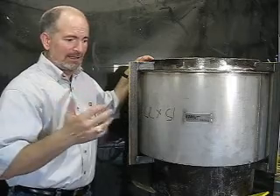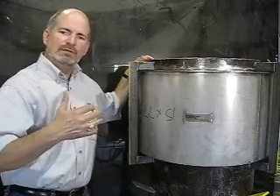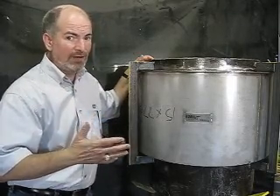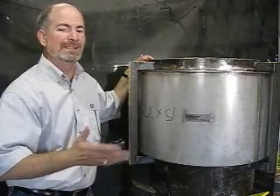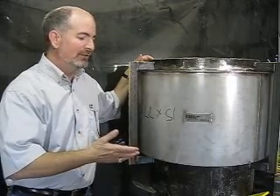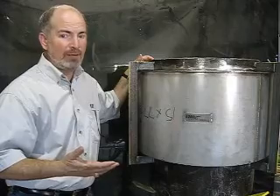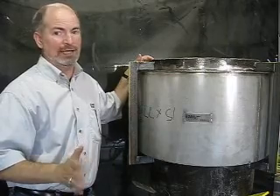That's going into the LP turbine — a dark place — and taking a look around. Now, if you've come to the decision to replace some of these: if you've never replaced them in 25 years or longer, it's time. You'll have cracks, and you'll be losing BTUs due to lack of turbine efficiency if you've got leaks. If you're pulling the hood and it's going to be a while before you pull it again and these things are 25 years old, it's time to replace them. They've had a good run.